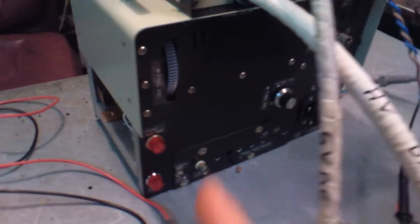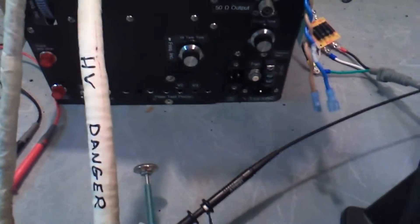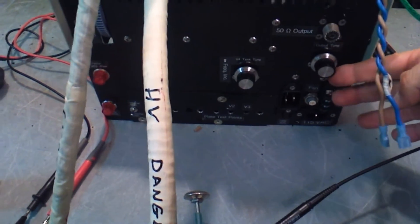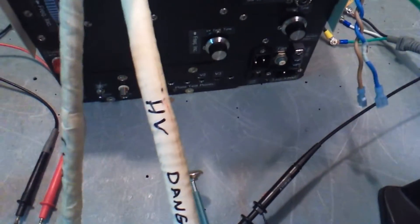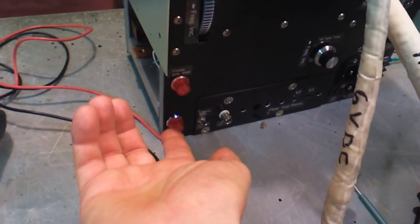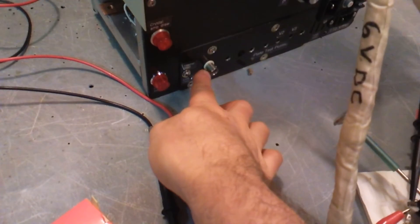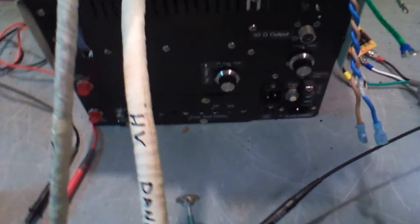This is the pi network here — adjustable. You can tune the pi network right here. These are three, four, or five turn air chokes. There's a 50 ohm RF output. You can change the crystal here, and there's a crystal amperage check point. You can run a BNC input here and switch it to either crystal controlled or run your own function generator to control it.